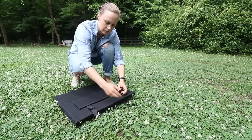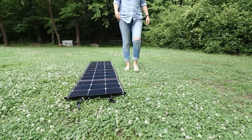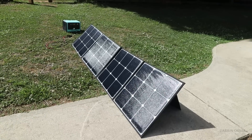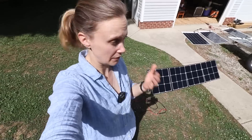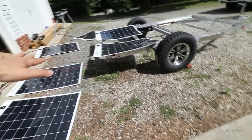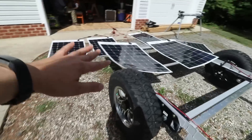It's nice that this panel is flexible, it's durable, you can pack it up, it's really small, and these are good solar panels — they're SunPower. But other than that, it's just a kind of pricey setup. On a cloudy day, but right now we have sun, we're currently getting 148–150 watts out of 200. That's great, you can't expect more than that. I also have six of my regular solar panels charging at the same time, so lots of solar going on right now.